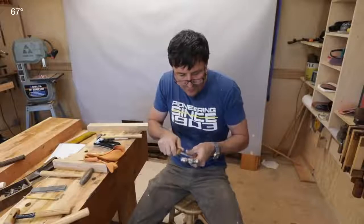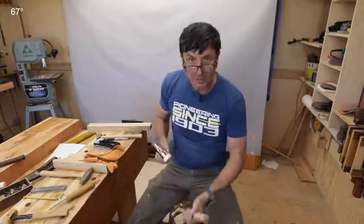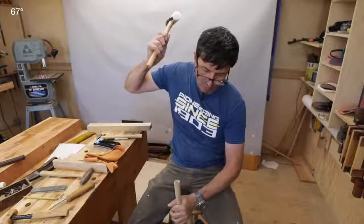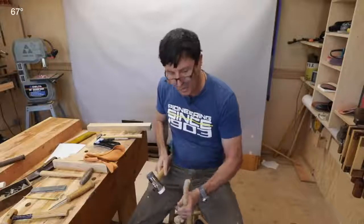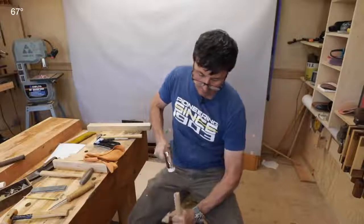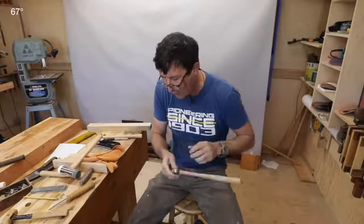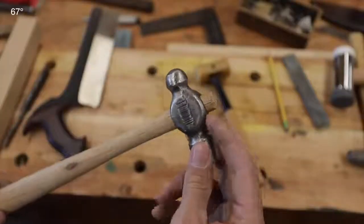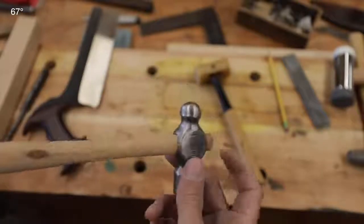Striking the bottom sounds counterintuitive, but nothing drives more force onto a handle than doing it that way. I've got to put a little chamfer on there. The trick with any axe head or hatchet is to hold it loosely in the hand — when you impact the handle, you want it to slip through your hands a little bit, and the mass of the head will hold it and drive it down. Use your senses — listen, you can hear it. It will drive it down so hard you won't believe it. This turned out really well — look how far we got that handle driven down and how tight everything is.